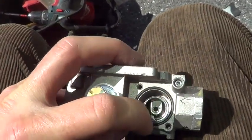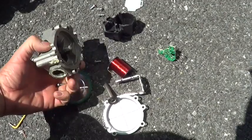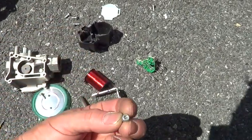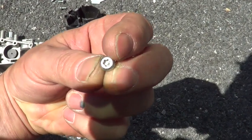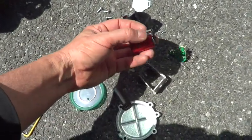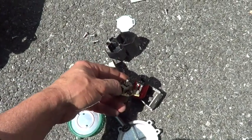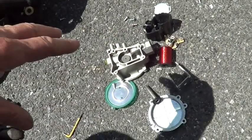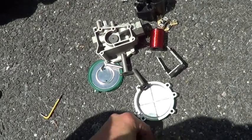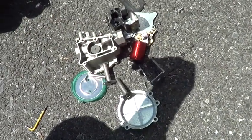I've never heard of these things failing to a non-safe position. There you have it — why a natural gas furnace gas valve is making an odor and leaking. By the way, these are tamper-proof; they have a little pin in the middle. Nobody's supposed to be servicing gas valves — you just change them out. Even if it's something simple, you're really not supposed to service it. They're designed to fail to a safe position, and when you service a component like this, you can create engineering changes that alter that design. You're not supposed to be redesigning anything that has to do with safety.